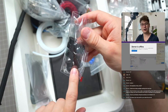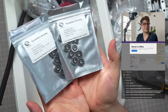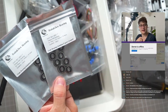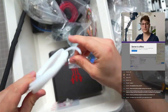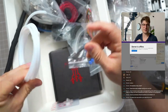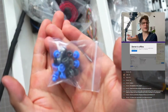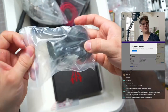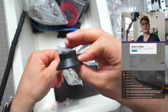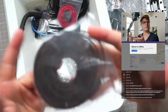Then we have some pulleys, which we will need for our belt setup. We have bearings for our belts - I'm curious whether they're the same as currently on the Ender. I wasn't sure, so I just ordered them anyway - about 20 in total. A couple of Bowden tubes - this will connect the two M4 extruders with our StealthBurner hotends. So we will not have direct drive - we will have Bowden extruders. Collets to connect the Bowden tubes, StealthBurner LEDs, and then we have the feet - rubber feet that go under the printer, the same ones that go on the 2.4 and Trident. We have our Gates belt - I checked, they are genuine Gates.